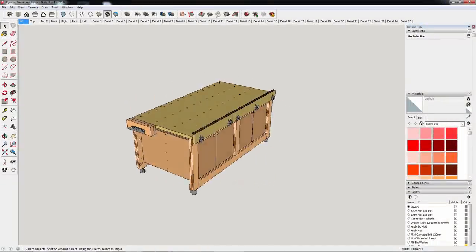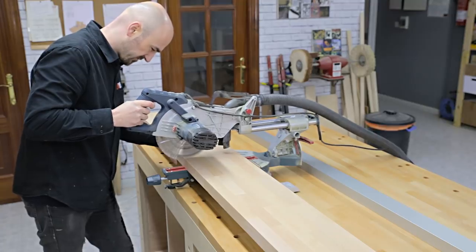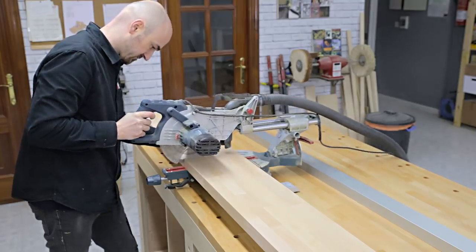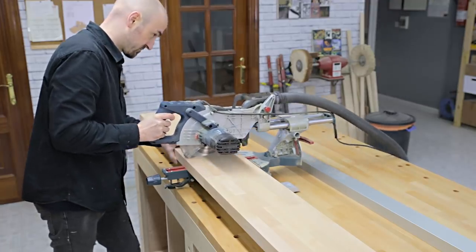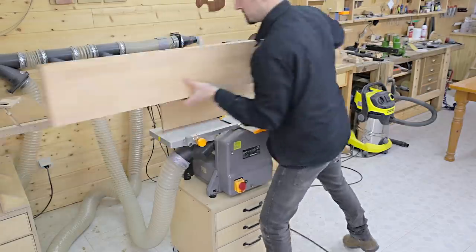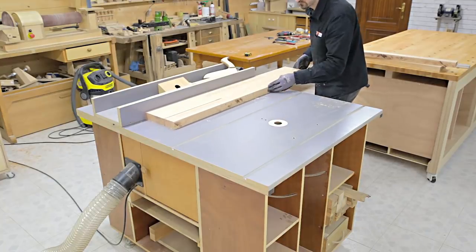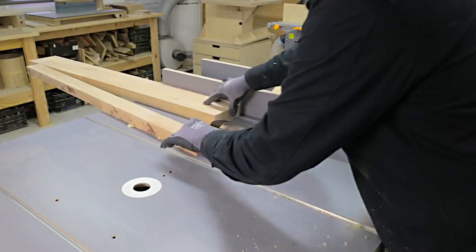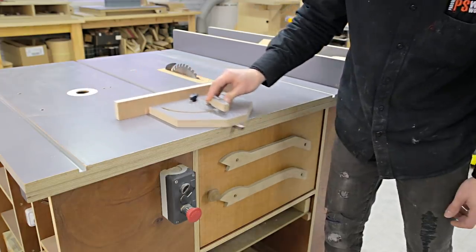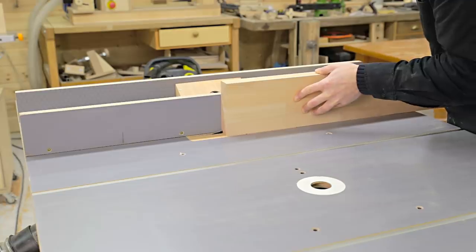Using the leftover scraps of wood from the benchtop, I'll make the pieces that make up the rip-cut guide. I make them straight with a planer and cut them to size. I have to make grooves to slide in the T-track guides — we could also use a U-shaped aluminum profile here, like the one I installed on my table saw. With that same saw, I'll make the grooves in several runs.